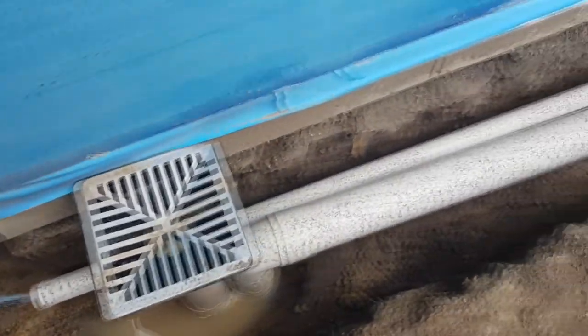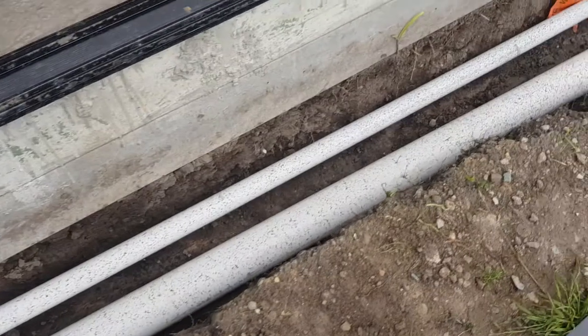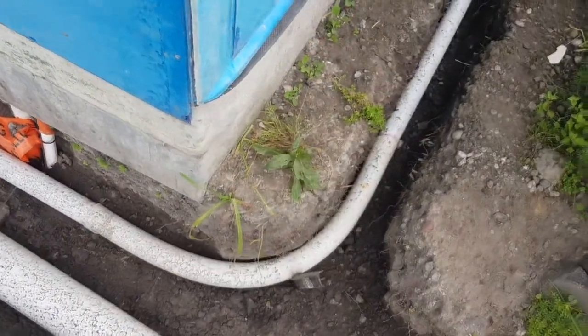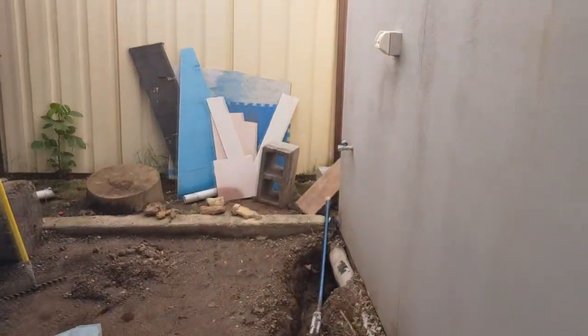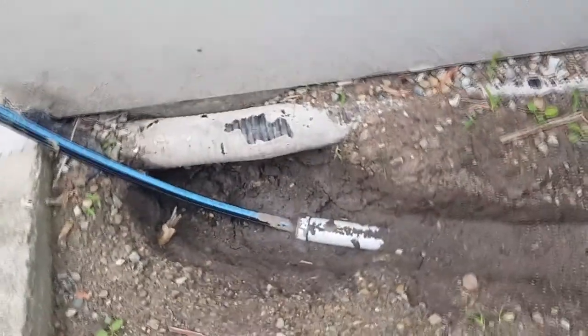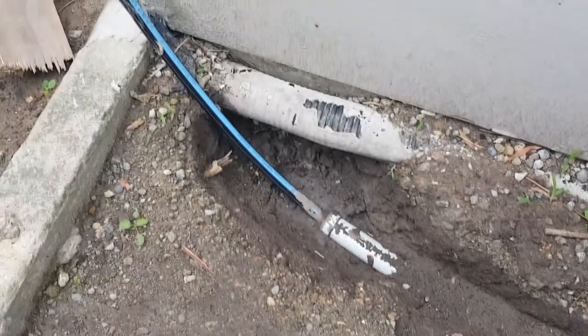The soil has got some small gravelly components that over time may work to puncture the hose, so I've dropped that 50mm line all the way around, made up a custom corner so it goes around the corner and continues through — you can see where I've already started to bury it — then it comes out to the back of my workshop where I'll connect the water main. It's capped on the end so soil doesn't migrate in, meaning if there's ever an issue I'd only have to uncover either end, pop off the caps, and feed a completely new hose down that pathway.